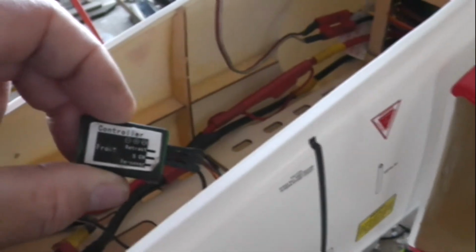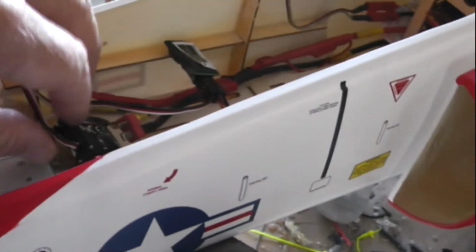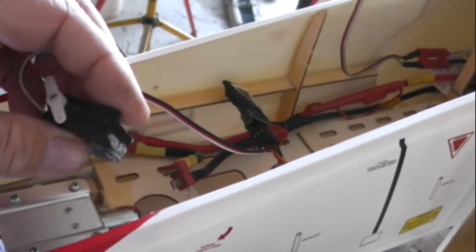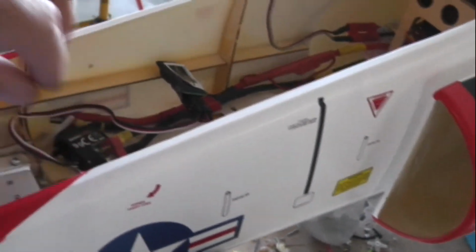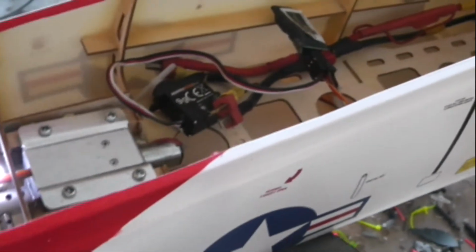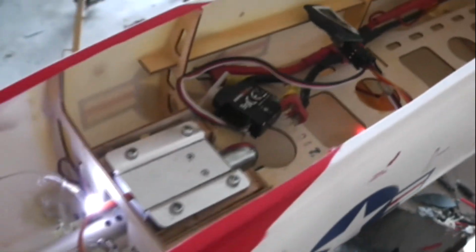Well, it seems that the gear sequencer is designed to work with servo-powered retracts, which is unfortunate because the electronic servos detect the pulse as a command to open. So as long as it sends to the servo first, the gear opens. But when it comes time to close the door, it can't. The electronic gear can't get past the pulse for the servo to close the door, and they both go at the same time, which jams the door in the gear.